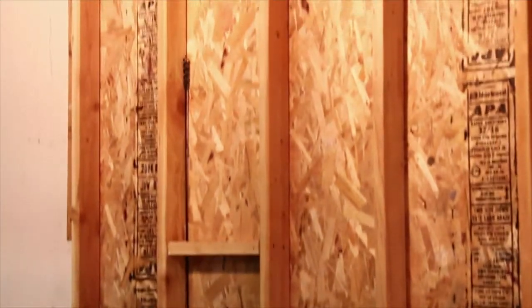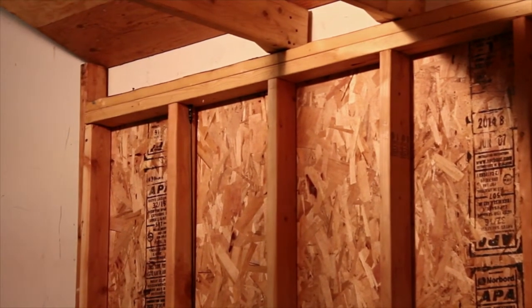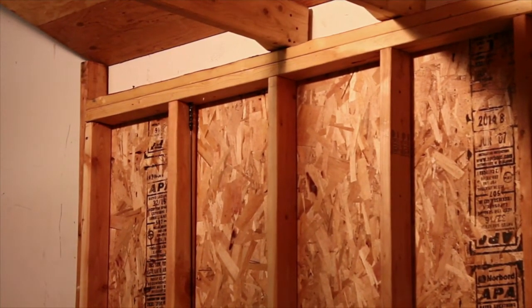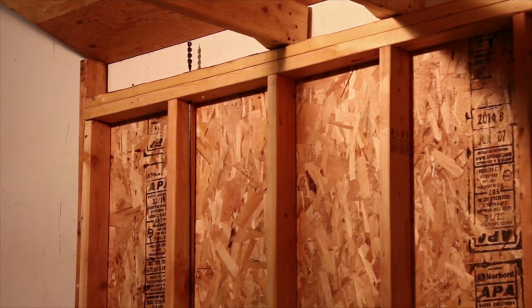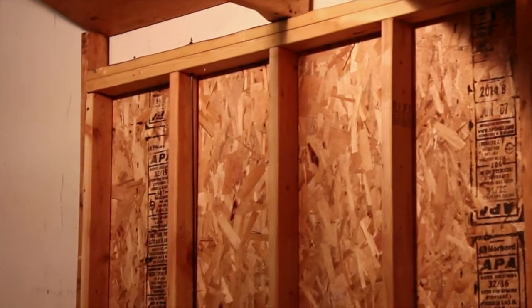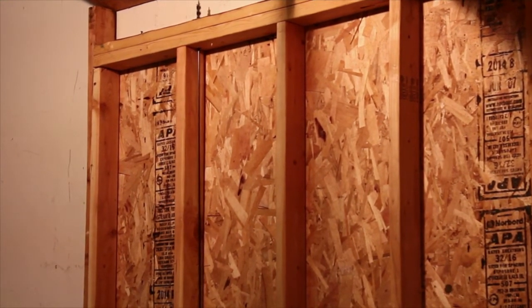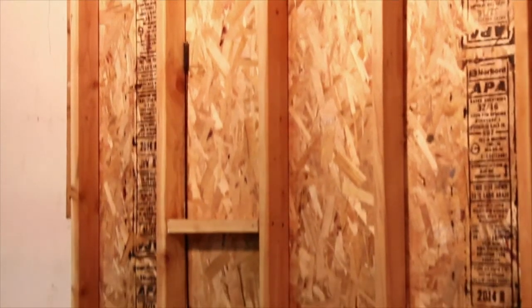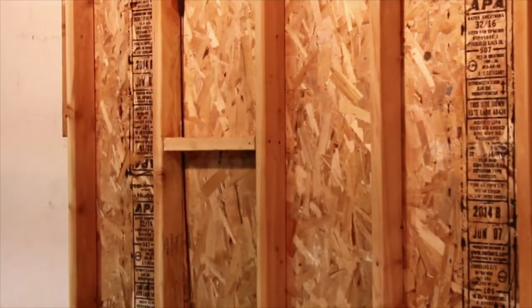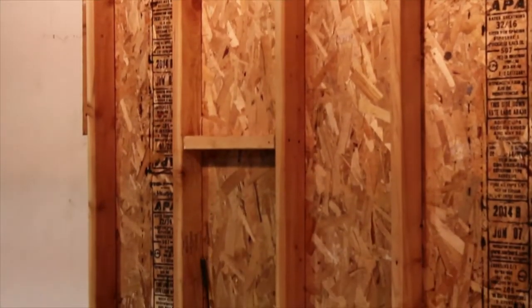Now just keep walking the bit up until you reach the top plate. When you reach the top plate, always remember that you will be drilling through 4 plus inches, so you should stop and reverse the rotation of your drill a few times while drilling to clear chips. Clearing chips at any sign of binding, or whenever you are drilling through more than 2 inches, will keep your drill bit from snapping and being lost in the wall. Reversing the rotation of your drill will make it easy to pull back out.